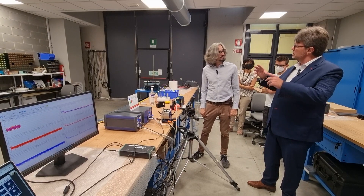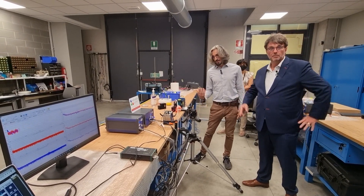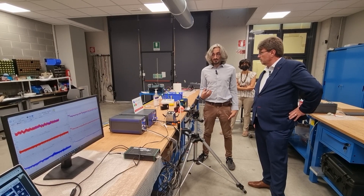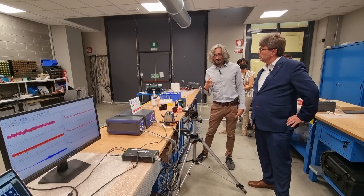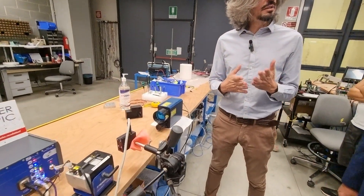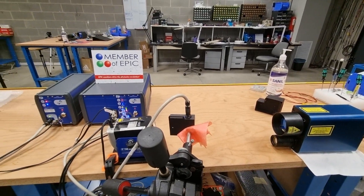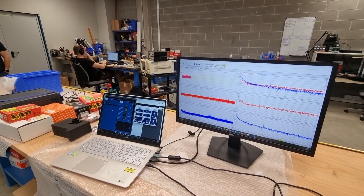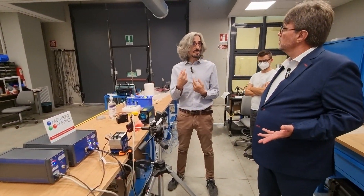There's an emitter and a sensor, but somehow you don't have a separate sensor? All our instruments are based on a technology called self-mixing interferometry, where you basically implement an interference system without having a real physical traditional interferometer. So we get rid of all those optical components that are typically part of the Michelson interferometer. The sensor is made by the laser and tiny optics — the laser acts as both a light source and a detector.